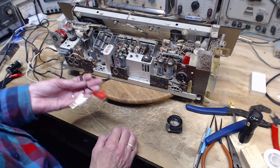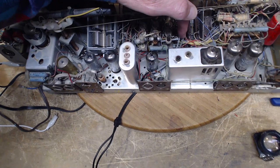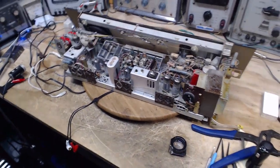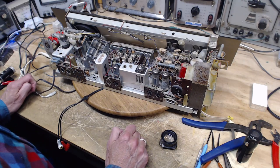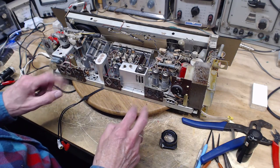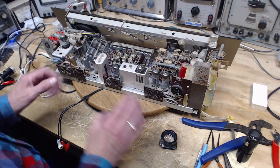When I attach these cords, I looked at the back of this. Look at the back too. I'm going to see two shielded wires. Here they are here. Okay, two shielded wires. So the shielded wires are carrying, let's call it a fragile, weak signal. That's why they're shielded. Must be conveying the weak signal from the tape deck, or in my case, the Bluetooth receiver, into the sensitive amplifier and then out to the speaker. So they're using shielded cable.